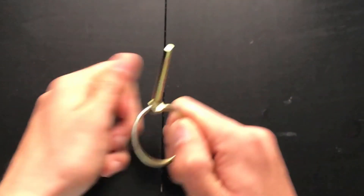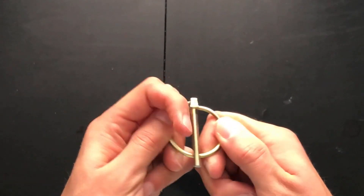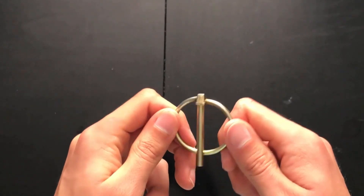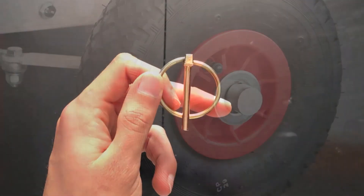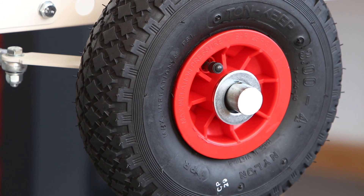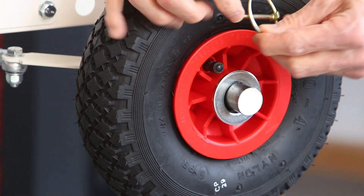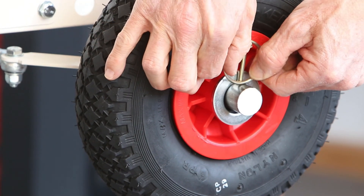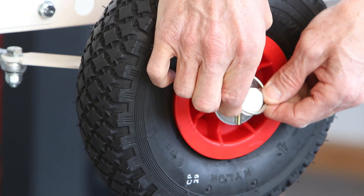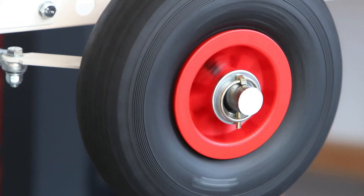Words of warning — the lynch pin is a sprung clip. If you catch your fingers in there, it will hurt. You've been warned. The best way to put this on: put the little tip of the pin down into the top of the hole in the axle, then fold both sides of the ring, push down, and then let go of the ring. And it's all done.